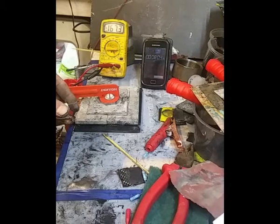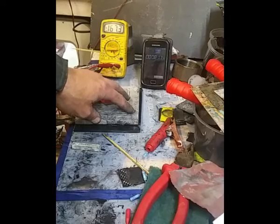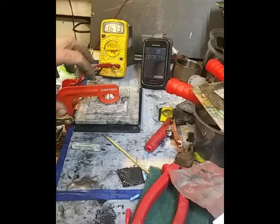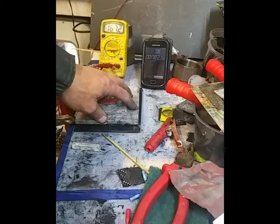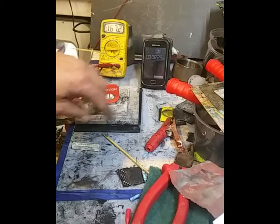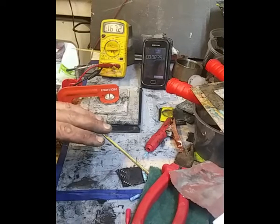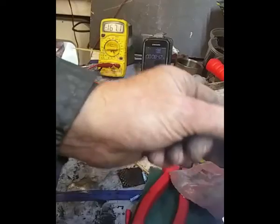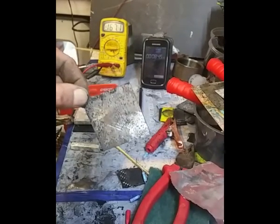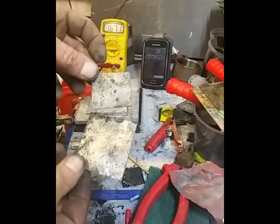That's my newest latest piece of magnesium and I don't want to ruin it. For the footprint it's not brilliant, but I suppose it's the capacity in terms of energy and how long it will give you that energy. I've had over 2 amps out of a piece like that, and 2 amps out of zinc — different electrolytes, different metals, different stories.